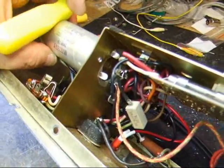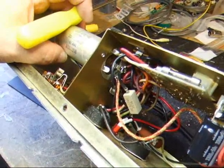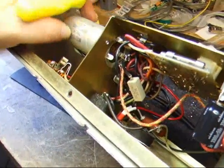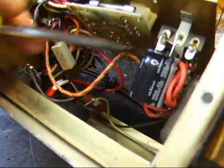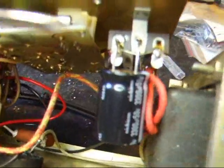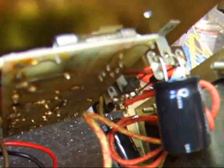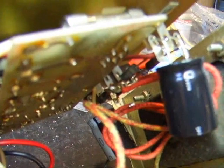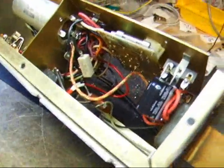Additional factors in this particular instance: check and see if you have any loose connections and things like that. Make sure the leads aren't too long when they go through the terminal strip. It's perfectly alright to put them through the terminal strip that way — that's often done in television and radio work, especially back in the 60s. It fits right in.